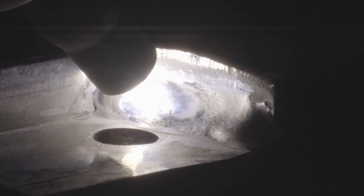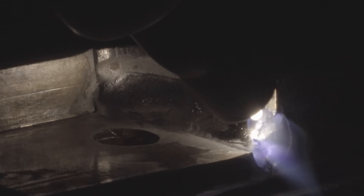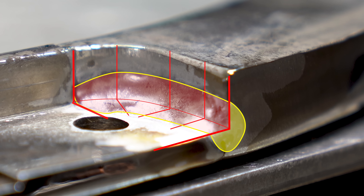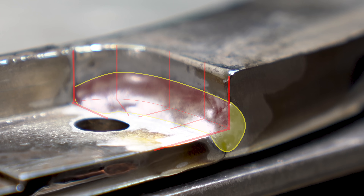One of the final stages after filling the metal in is to mow it back down, which means I'm going to go full power on the machine and move the torch back over the bead to make sure it blends in and flows. With that complete, we can see the result. Now once we cut down the red section back to original condition, the yellow will stay, leaving plenty of fresh metal to hold this piece together.